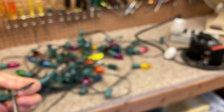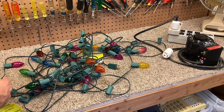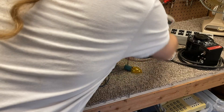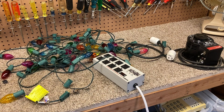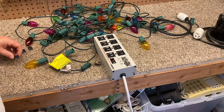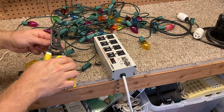If you're running more than one string, that diode is going to get really hot and you'll have to put it on a heatsink, probably with a fan over it so the diode doesn't overheat. The worst that can happen if it does is it just sends full power to the string again because the diode shorts out — which is obviously exactly what you're trying to prevent. For this test we're only running one string with half the bulbs, so it won't matter, but in any other use case make sure you have proper thermal management. For the entire Christmas tree you'd probably only need four of those, but that's pushing them kind of hard since I think those are 30 or 40 amp diodes.